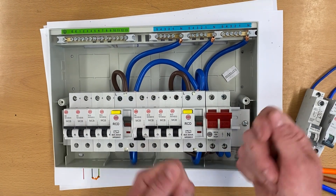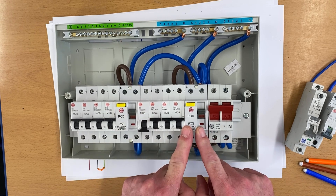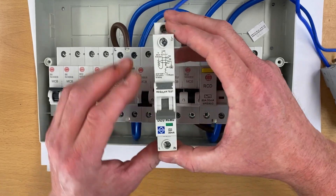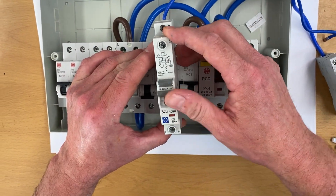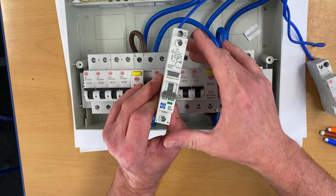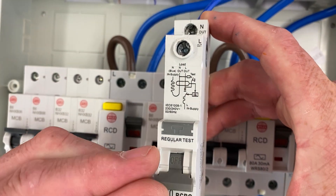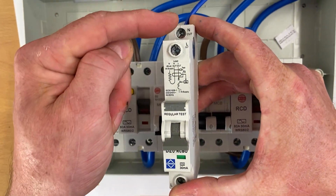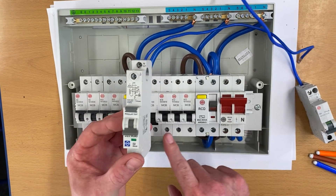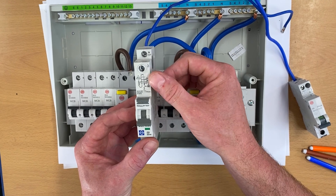You might be out in the real world and think you've done safe isolation, turned off your device, and you haven't got that beep. There could be a number of reasons. It might be that you've got an RCBO instead of just an MCB — an RCBO has both a neutral and line connection in it, and when you operate it you might break not just the line conductor but the neutral as well. You need to look at your devices carefully and check the diagrams on them to determine whether you have a switched neutral. This particular RCBO doesn't have one, so even by operating and locking it off you've got a solid neutral link all the way back, and you'd still get that continuity beep.